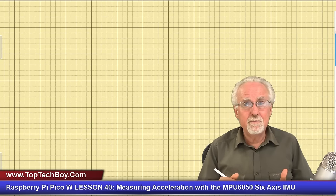What do I mean by microscopic? Some of the component dimensions we were building were like one micron. For size comparison, a human red blood cell has a diameter of 10 microns, and we were building devices with dimensions of one micron. We were building mechanical elements on the same integrated circuit substrate as the transistors, so you could have the test electronics built adjacent to the mechanical elements. Now we can build microscopic mechanical elements — so how could we use that fabrication capability to build an accelerometer?